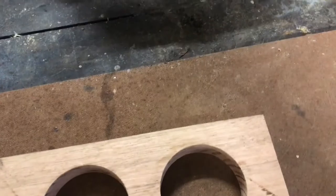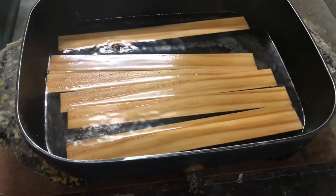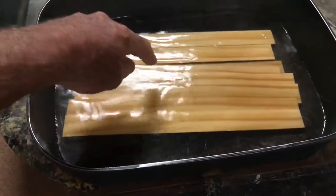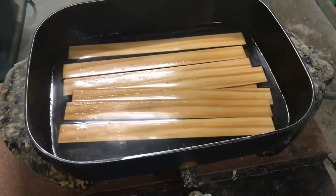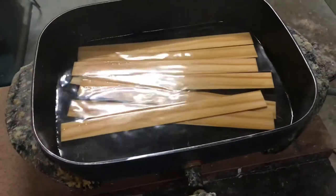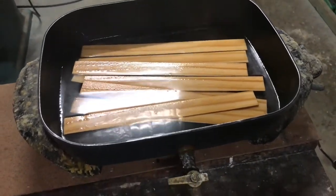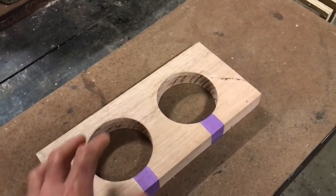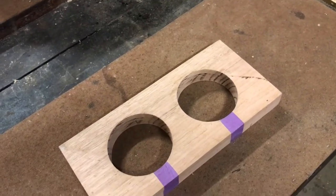The rest of the process is very similar to what I was doing before. As you can see I've got my timber strips being prepared — they're warming up. You can see that water there is just on a simmer at the moment. These strips have been in here for about seven or eight minutes and they're just about right to go. So what I'm going to do is set up a camera and I'll show you exactly how I form these and hold them in place. I'll be back in a minute.